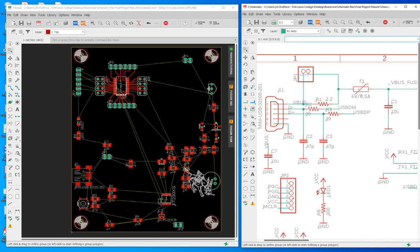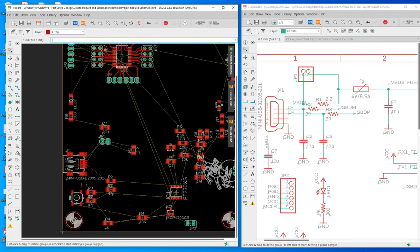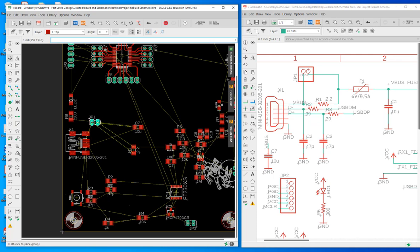Okay, so USB has the JP1 next to it, right? So USB, JP1 on the top, so we can keep it here, right? And then you got R1, R2, R3. Okay, try to avoid these tangled wires as much as possible. It's too close to it, so let's move it a little bit to the right.